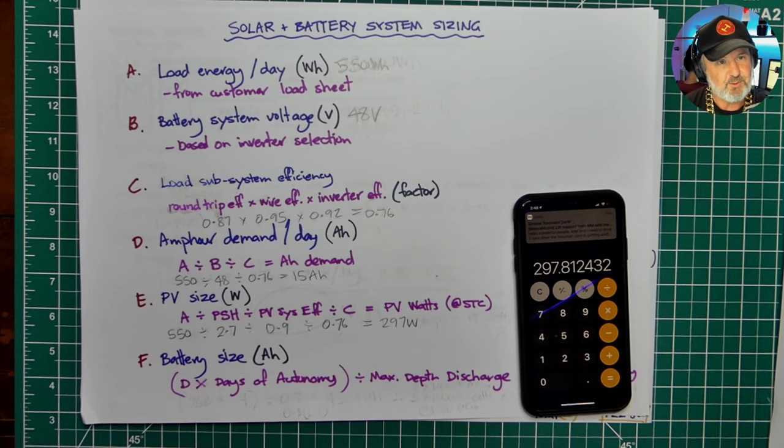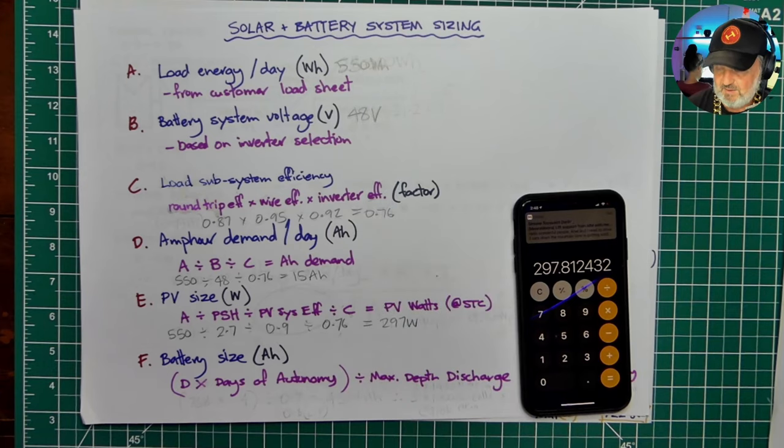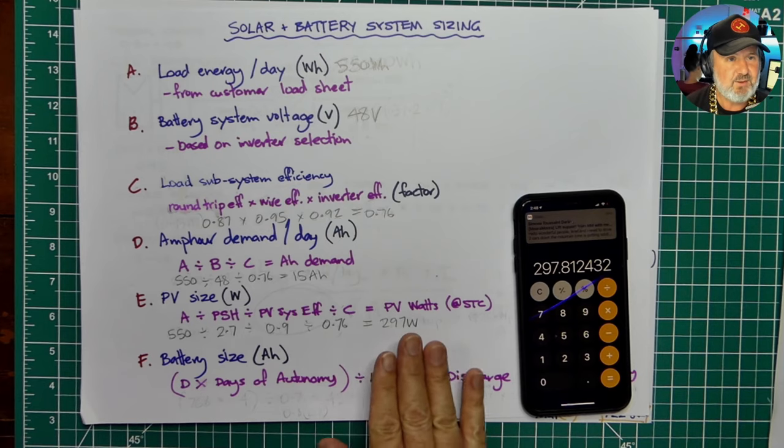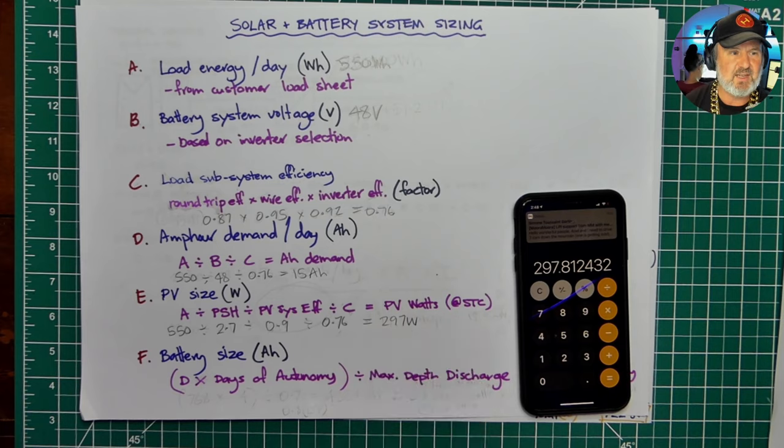It's very doable. I said that Elise had room for 800 watts, well, she's got 800 watts of panels on her tiny house. And if that number was true for her, but actually I think she's a bit higher than 550, she'd only need 300 watts. So there's a minimum. There's no maximum. Actually, oversizing makes a lot of sense, and I'll come to that in a second.